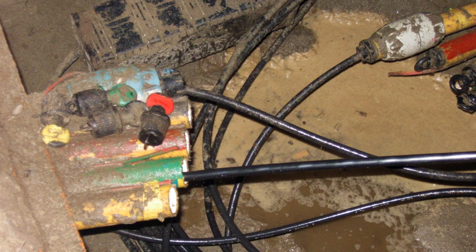Cable jetting is the process of blowing a cable through a duct while simultaneously pushing the cable into the duct. Compressed air is injected at the duct inlet and flows through the duct and along the cable at high speed. Preferably, no suction pig is used at the cable head. The high-speed air propels the cable due to drag forces and pressure drop.